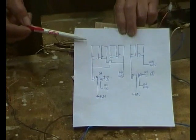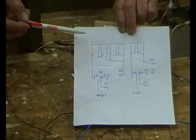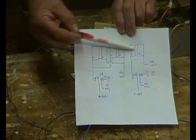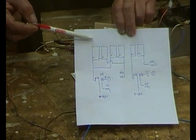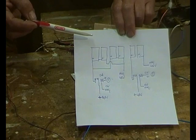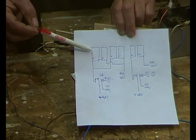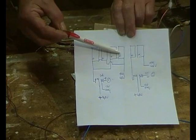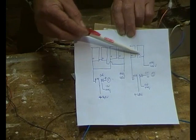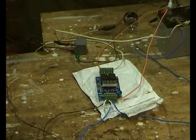There are two sensing relays on the VLC v20, so we have another one here for two panels. Imagine it's been gray for a while and then the sun comes out and pours loads of sun — these are all charging like mad. With lead-acid batteries there's a point where you can have too much charge and the voltage rises dramatically even though the batteries aren't fully charged. So effectively what we're doing is switching some panels off, and if the voltage rises more, the remaining ones switch off too.